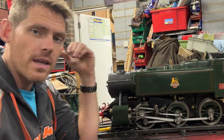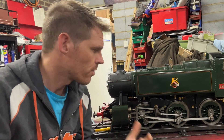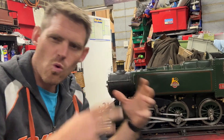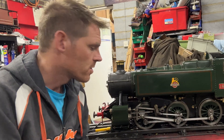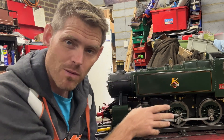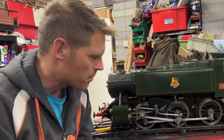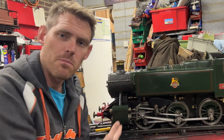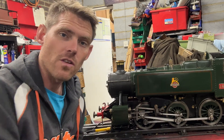I've had this problem before on my three-and-a-half Britannia. The builder had pinned the return crank through the pin, done it across through the pin. But the valve gear is all quite weak - there shouldn't be any real load, especially on a piston valve engine. So personally I don't pin any of my return cranks; I rely solely on the grip of the pinch around the pin. If something goes wrong I don't want to bend valve gear rods or break something in the piston - I'd rather it just slipped so I can reset it. I tend to scribe a line across so I know where to put it back.